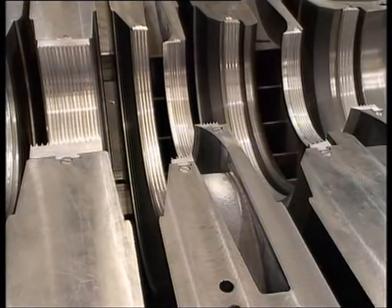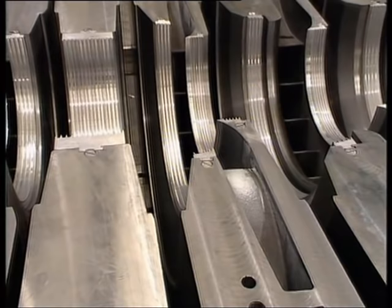Easily removable labyrinth seals are installed on the diaphragms at the impeller shrouds to prevent return flow from discharge to suction, and on the shaft sleeves to eliminate interstage leakage.